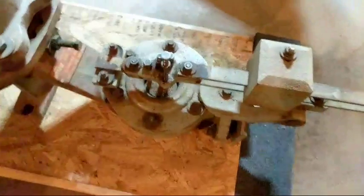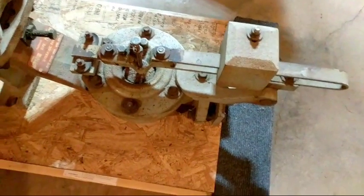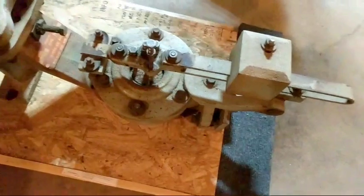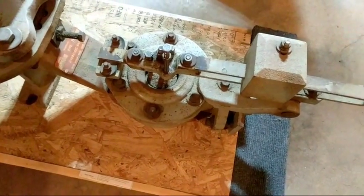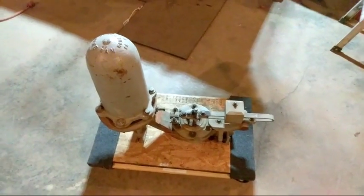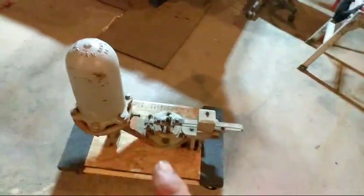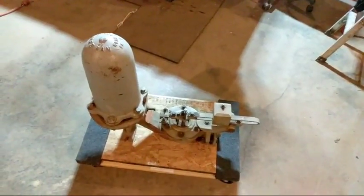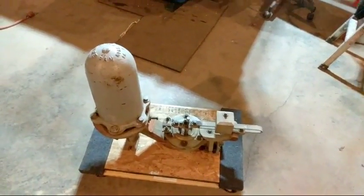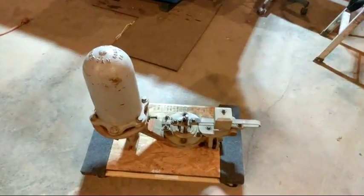The more beats, the less water, believe it or not. The fewer the beats, the more she's working and the higher she'll lift and the more water she'll pump. It'll get to the point where it just kind of floats and flutters. And that's important because seasonally your volume could be changing from your source. So the ram is fully adjustable to match the seasonal flow of your water. The biggest mistake on a ram is sizing it for the rainy season. You want to size it for the driest drought-type season because you want this thing to run all the time. So it's better to go with a smaller ram than a bigger ram.